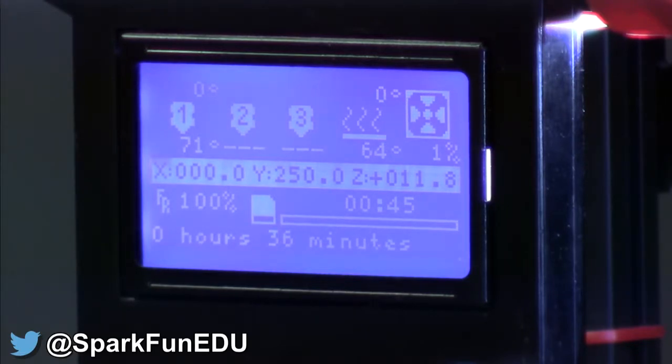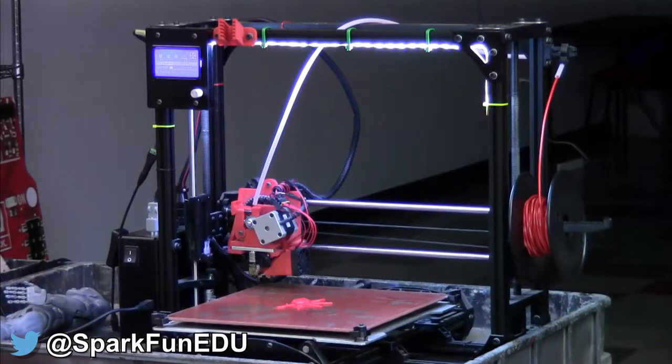And again, like the printer bed, I've discovered through experimentation and running that a generic 115 degrees has worked historically for me over the recommended 110 degrees. And again, per different filament and different materials, those temperatures will vary. For instance, ABS is like 110 and 240. A PLA might prefer its bed at like 60 to 80 degrees Celsius, and a nozzle temperature of 180 to 200 degrees Celsius. So you can use the profiles as a starting point, but these are all just recommendations.